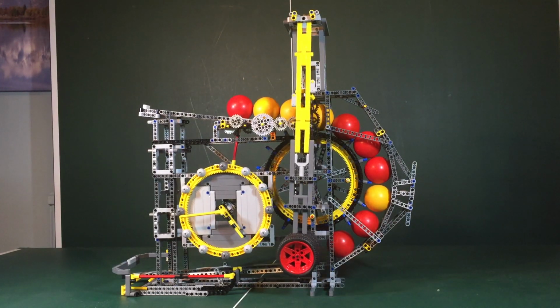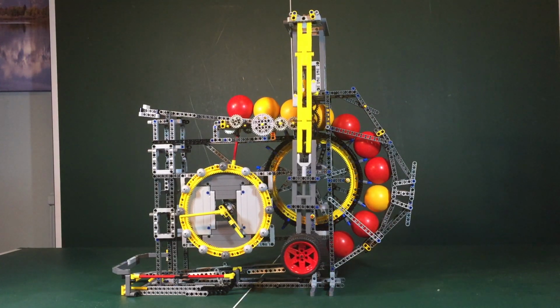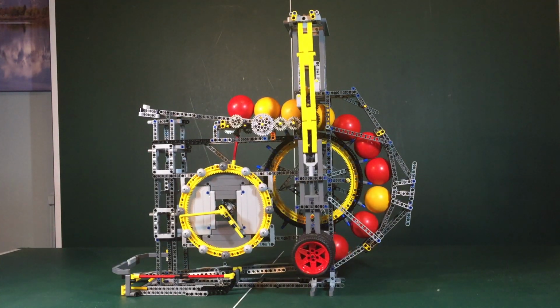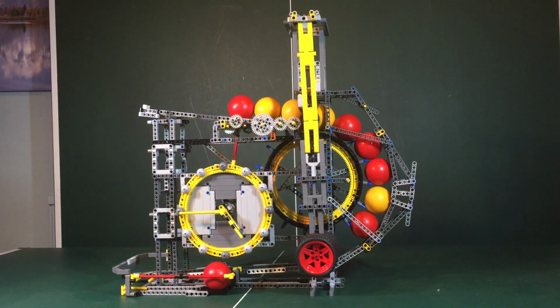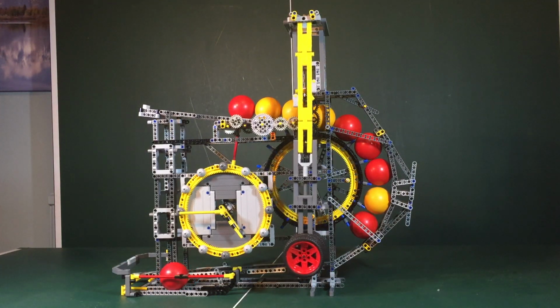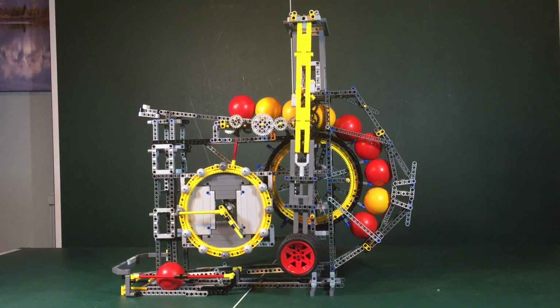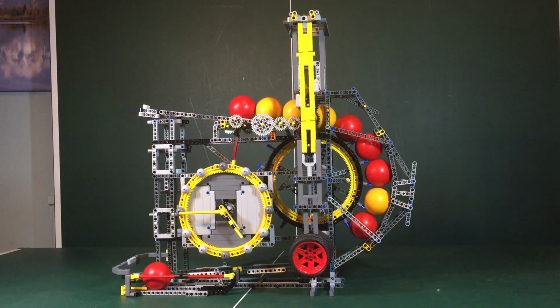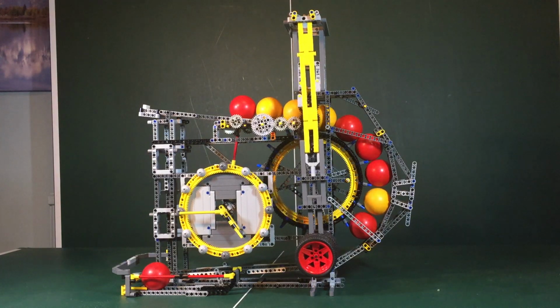I would love to improve the design and make it more practical as a clock that can run for up to 36 hours on a single loading of pool balls. Areas I will therefore be looking at then are a more efficient escapement with less rotation per tick, a higher gear reduction between the Ferris wheel and the escapement that doesn't suffer stiction, and a better overall layout to compact the clock frame while still handling the same or more balls.